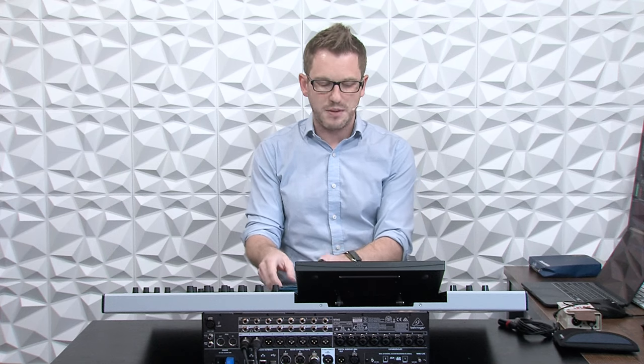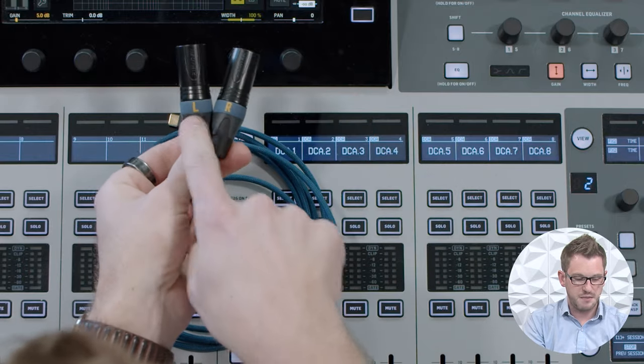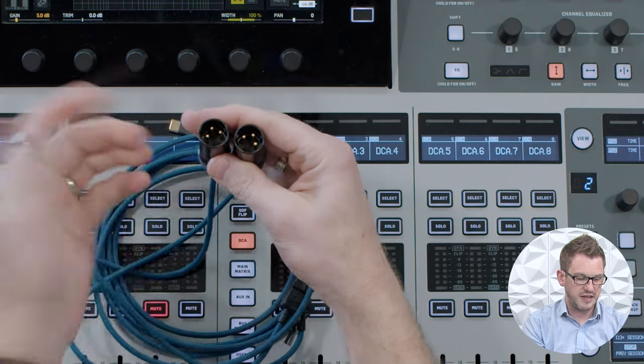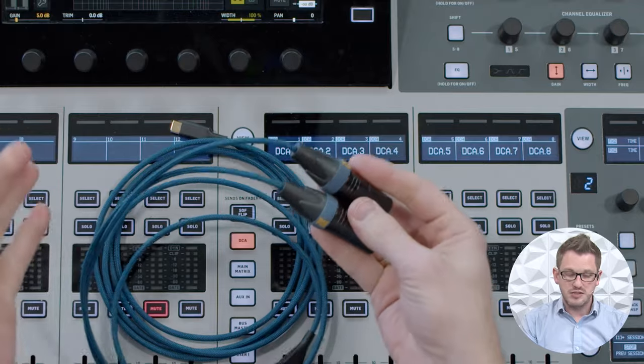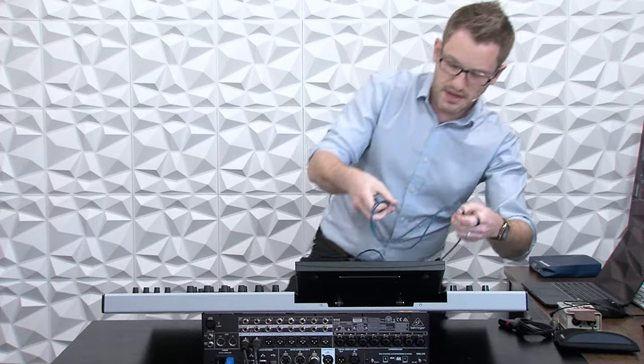The other thing about this is that it will remove any ground loops you have between your device and your soundboard. That's the other key thing that the direct box and the SoundWire do — they isolate that and make it so there is no ground loop that can happen because of the isolation transformers. The very last thing I want to mention is that there is a beautiful left and right label and it is gold-plated with Neutrik connectors.